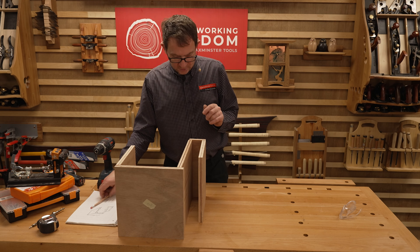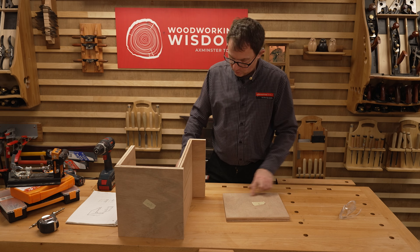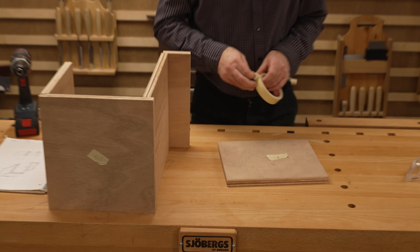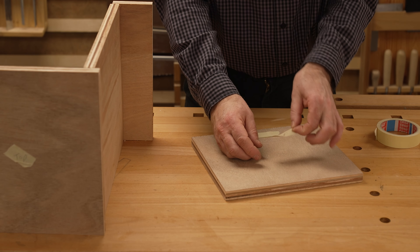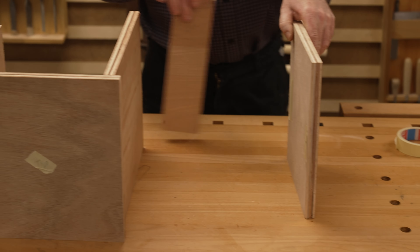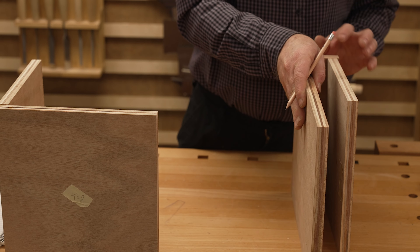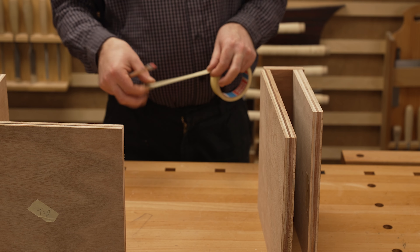So where am I going to do it? On the frame here, I've got to come down from there - so my pocket holes will be along here. Instead of marking it directly, I'm going to put a tape line down the bottom there, and I'm going to do a pencil line across it so I know which way it goes. This board - the sofa is here - so let's do the screws on that inside face so they won't show.